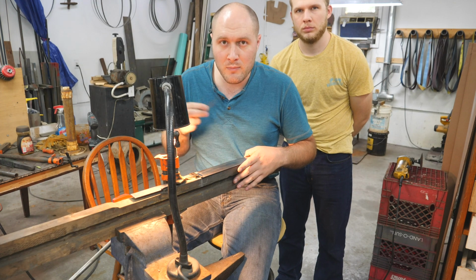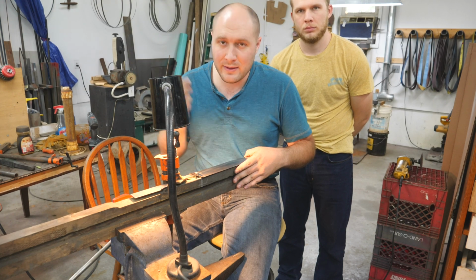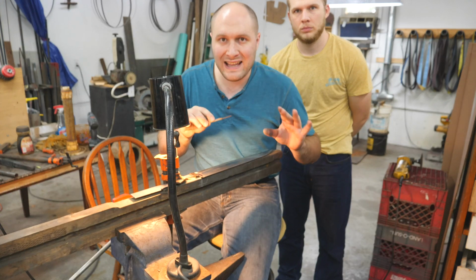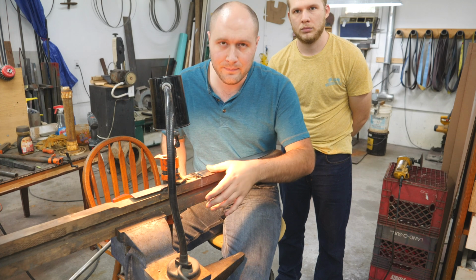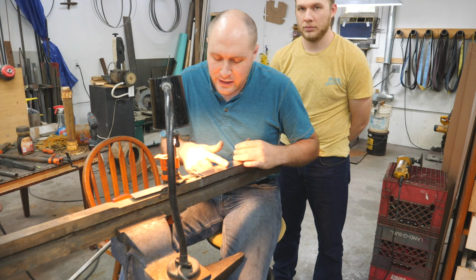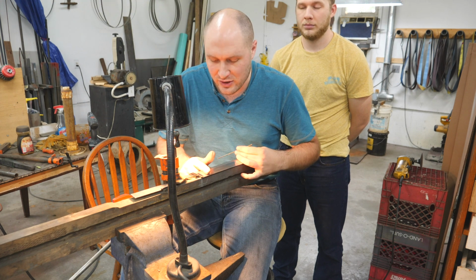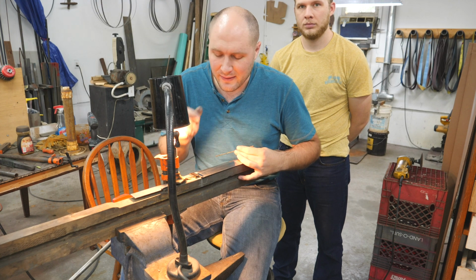The lower you go, the more scratches you're gonna see. But that might work great for the knife you're making. It just depends on the amount of time and how fancy the knife is gonna be. Really gauges how fine of a grit you take it to before and after etching. But I used to do a lot of 600 grit finishes. I've been doing 1000 for a number of years, but now I've just started doing 1500 grit, and I'm really liking the subtle difference that gives me.